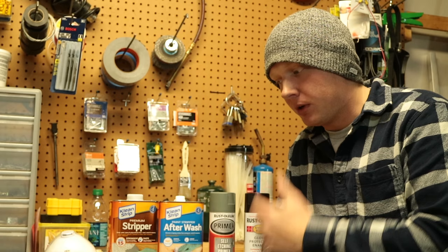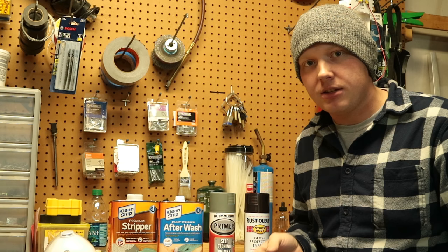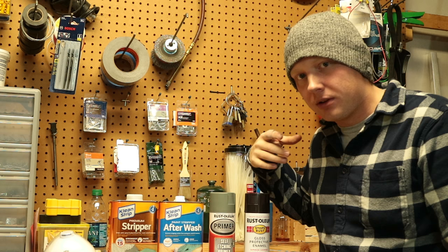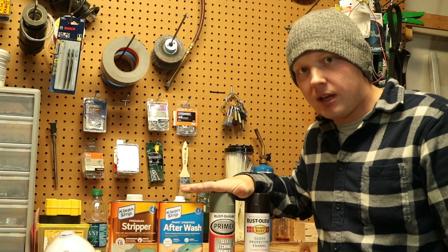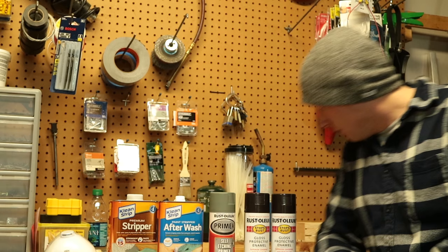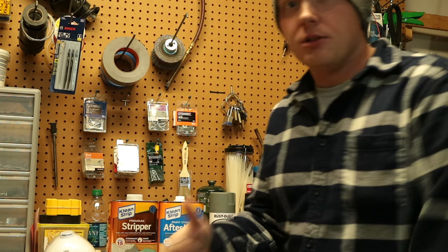What I'm going to do is strip it, clean it off. I'm probably going to sand it down again just to make sure it's a pretty coarse material before I put the primer on there. I think I'm going to put two, three, or four coats of primer on there. This says it adheres better when used in 70-degree weather, and it's a little cold out right now — my garage is currently at 60. So we're going to get the heater going pretty heavy and see if we can get the temperature to rise. And this is what I've already been using — just a Rust-Oleum gloss enamel. This one's almost empty so I got another one, and I got this brush. All right, so I'm going to get to doing this and then we'll get back to you.